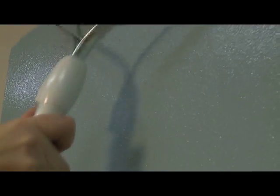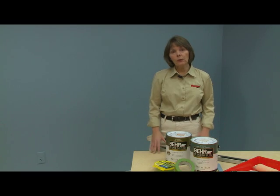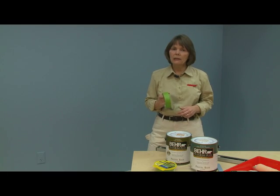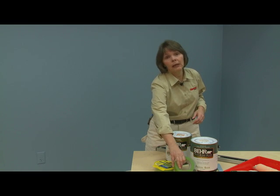First, you're going to start your project by painting a base coat of flat paint — two coats is recommended — and just do it as you normally would. Then we're going to use frog tape to mask off the stripes because it resists bleed-through. Be sure to have that base coat completely dry before you apply your tape, so that when you remove it you won't be pulling any paint off with it.